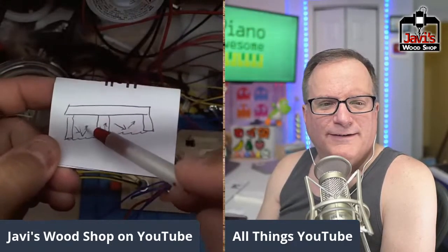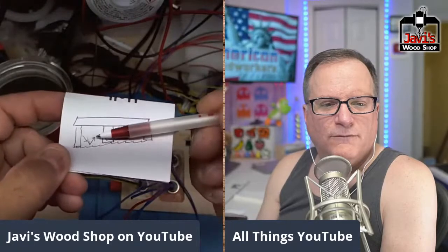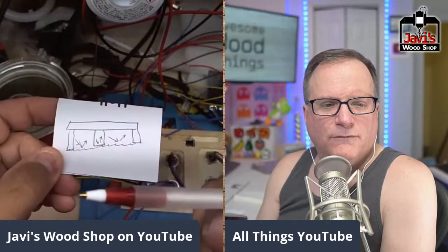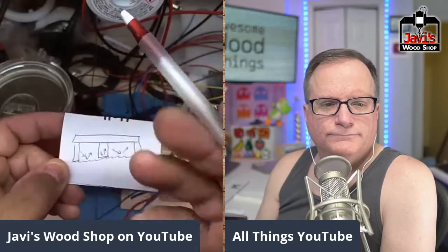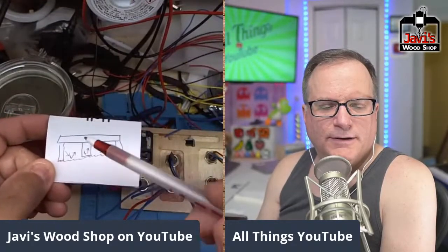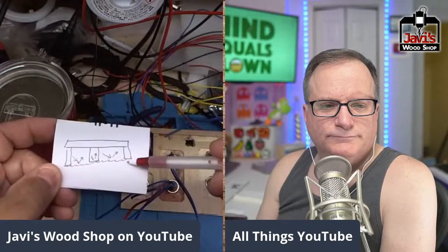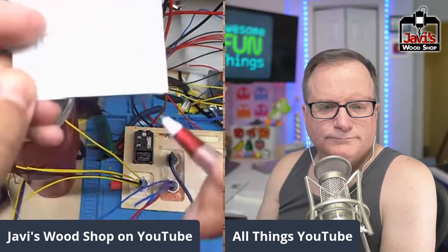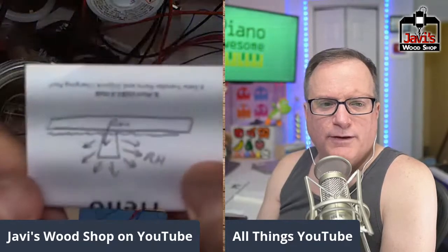These cavities, first of all, you should have on the bottom the soffit opening. There should be a good airflow because the other thing you don't want is for this to get moisture. And then you should have a ridge vent on top. So there will be airflow dissipating heat through convection. Because remember, we talked about right up to the ridge vent. And it's going right up through the ridge vent. So through convection, it'll dissipate the radiant heat. And that's it. And then the conductive heat has nowhere to go except through... pretend. If you did that first method, you wouldn't have the, what do they call those, baffles?